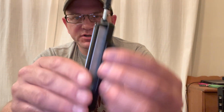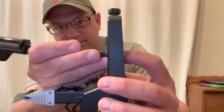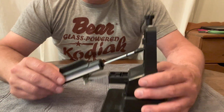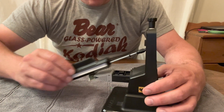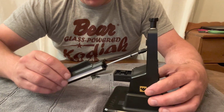So most of your sharpening is probably gonna be done with the 320 at first, and then you can kind of move on. So I know I said I was gonna do 30 degrees, but I'm gonna do 25 on this one. So just like this, we click in, just like that, okay? And I'm gonna readjust you here. Okay, so all we do, right, is just nice kind of even strokes like this. You can go back and forth. Someone's probably gonna say, well, you're not supposed to go both directions like that, but it doesn't really matter.